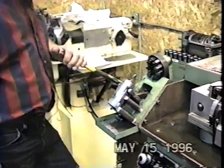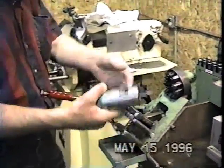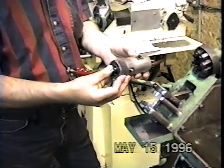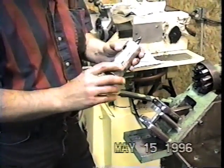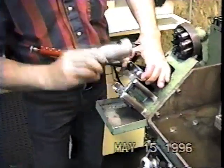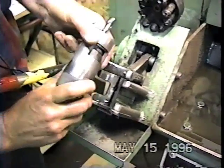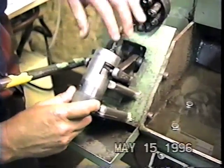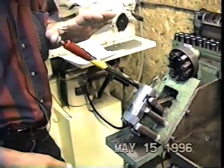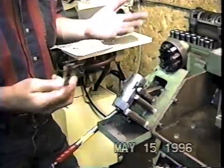Probably the trickiest and most difficult thing to master on this machine is the drill timer loader. It is designed to hold the drill and to time the drill radially. This drill holder has a very powerful spring in it and some collets — it has a pin on it. It has a slot here and a slot here. The slots have to fit into this yoke, and the pin has to go into this slot. And the bottom of the drill holder has to fall onto that plate. Get it in the cradle, get the pin in the slot. When I depress this button and push all the way down, I release the spring tension on the collet and the drill falls out.